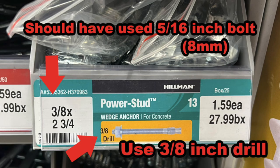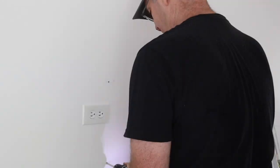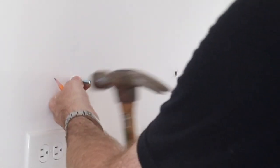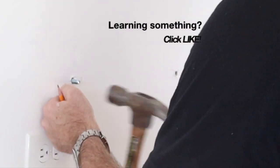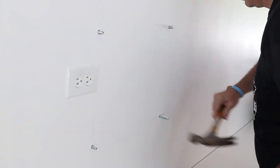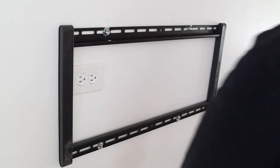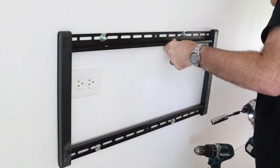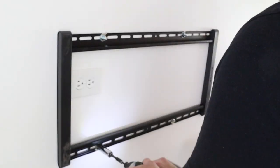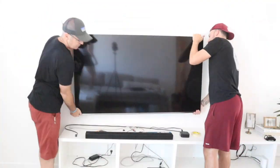Now that setup is complete, it's easy. I take that wood drill bit and drill four holes. I take my anchors — I wish they were a little smaller; they didn't fit perfectly in those slots so I had to adjust. Then I take my concrete drill bit and drill further into the block. I set those anchor sleeves in — I'd put the bolt on top so you don't send it through, and it helps figure out how deep they need to go. Once those are all in, grab your mount, throw it over, make sure it's level. I have a socket adapter that makes quick work of tightening those bolts and pulling them to tighten the sleeve against the block. A ratchet works here too. I make sure again it's level — a two foot level is great, a four foot level is even better.